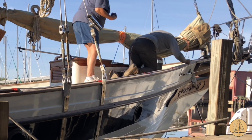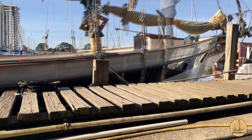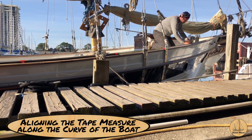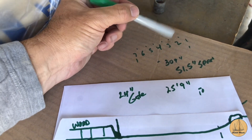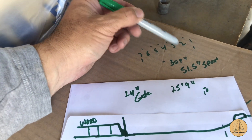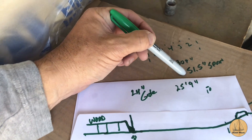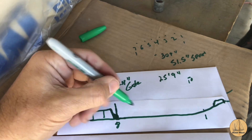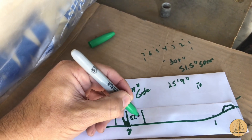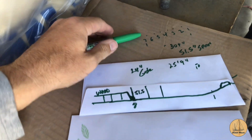Seven from this side of the gate is what was on it before. After measuring, we got 25 feet 9 inches. If I've done my math correctly, we have six segments — six spans between the first and the last stanchion — of 309 inches total. Dividing 309 inches by six gives us 51.5 inches per span. So each stanchion spacing will be 51.5 inches and will repeat on through. Let's go measure and mark it and see how it looks on the boat.